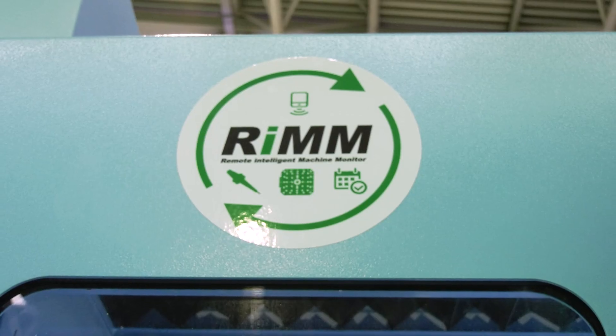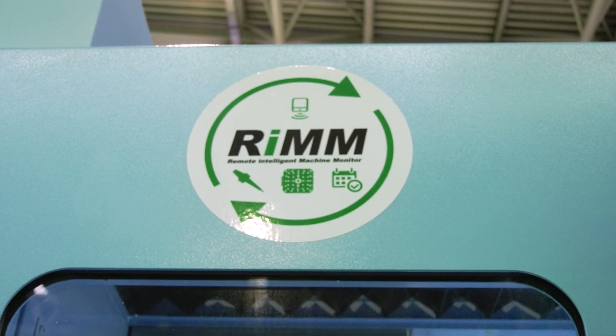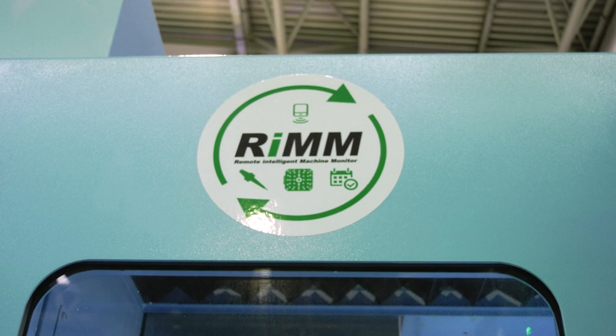If you take a single table five-axis machine, typically it's only going to run for maybe 25% of the time. Bear in mind you have to keep opening and closing the door to load and unload components. What this machine allows you to do is possibly do all your prove-outs during the day when the guys are there, but then potentially you've got another 16 hours of the day that aren't being utilized.